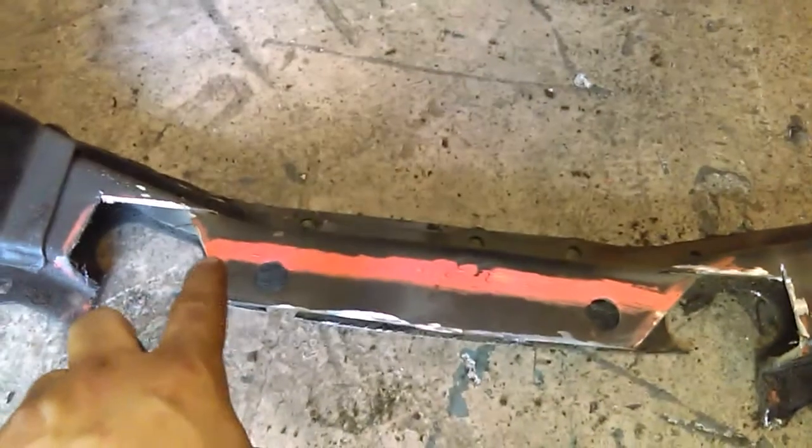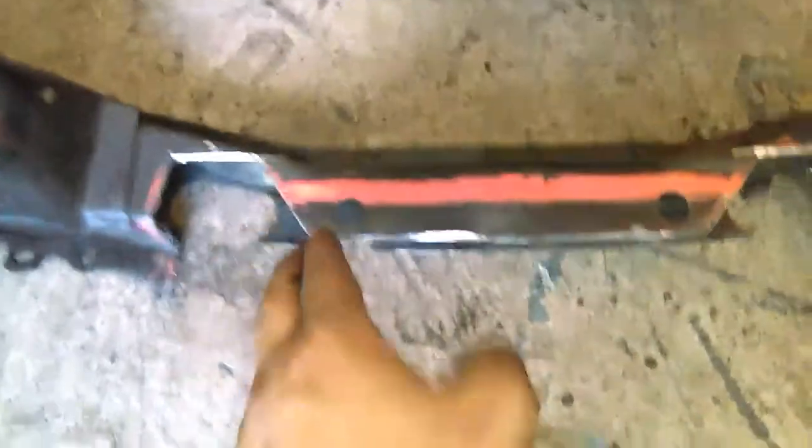Alright guys, that's cut out — pieces right here. We're gonna clean this up, make it even, clean that side and the back side. On this we're gonna cut it right there, like in the middle of that orange line, and then that rack will move up to that. Then we'll clean up around this, grind it where it needs to be, and the piece we cut off here we'll put on the bottom, measure it, cut it evenly, and weld it back together. Drew's gonna cut that while I go on the bench grinder and clean this up.